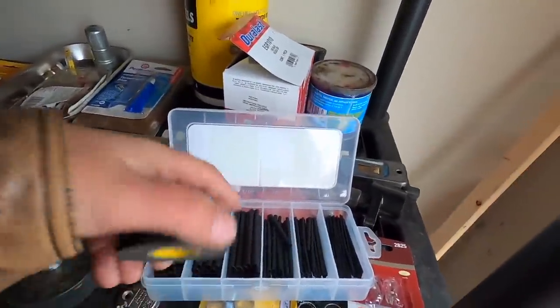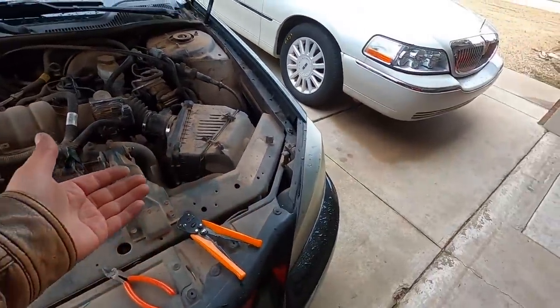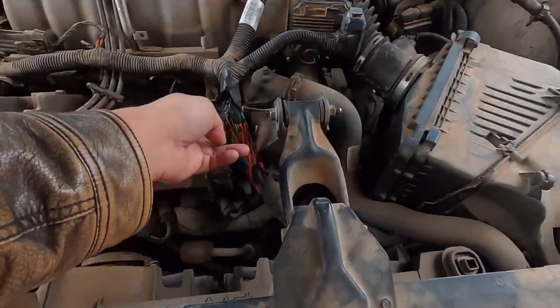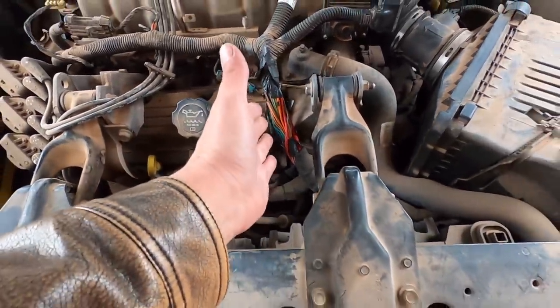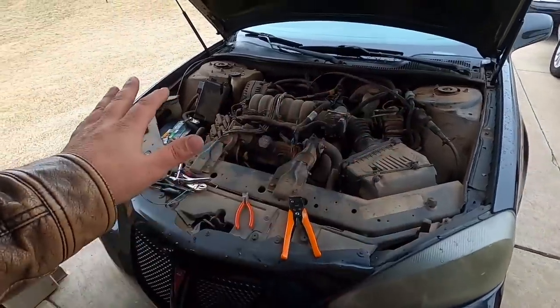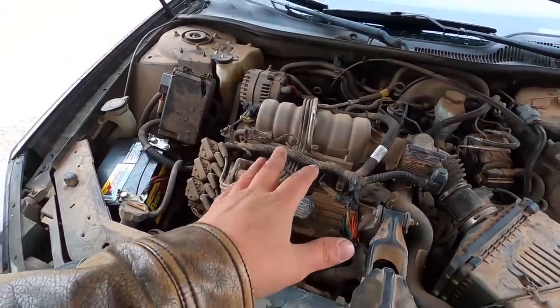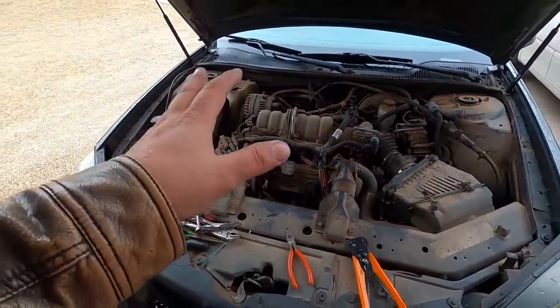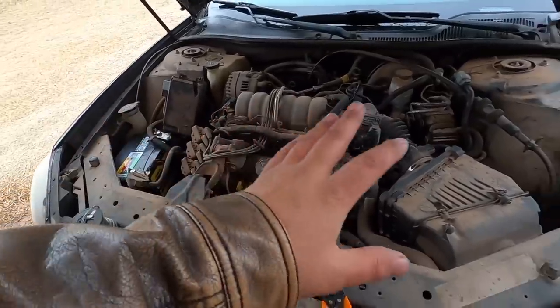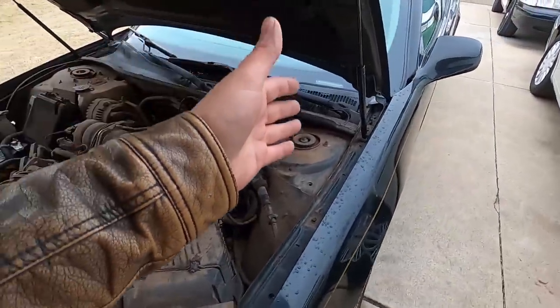All that's left is to bundle up this wire harness with electrical tape. I'm also going to find something to put underneath this wire loom — whether it's cardboard or rubber — to isolate the wires from rubbing up against that valve cover. If you have any GM that's a drive-by-wire system like this with the 3800 Series 3, this video could be very helpful to you. You should be tracing before you throw money at a new pedal assembly or throttle body.